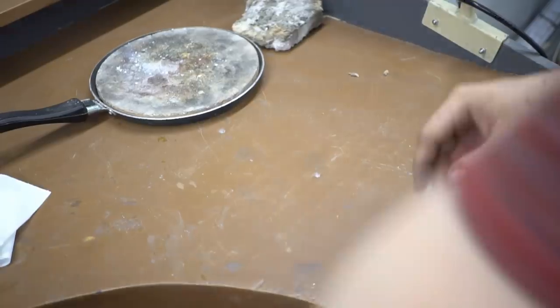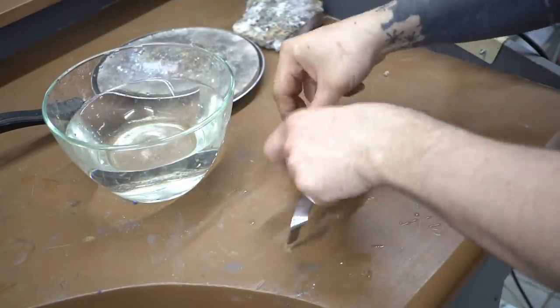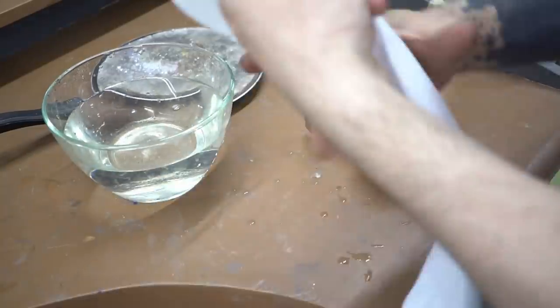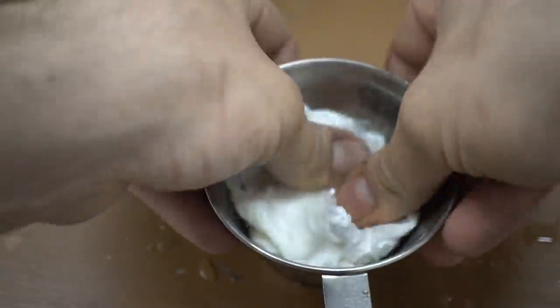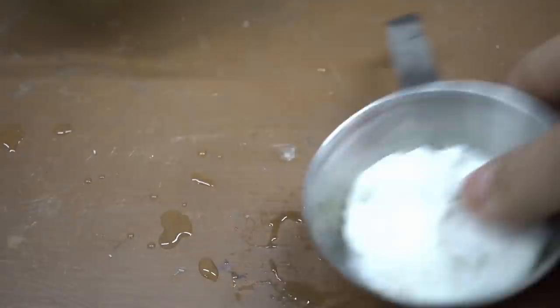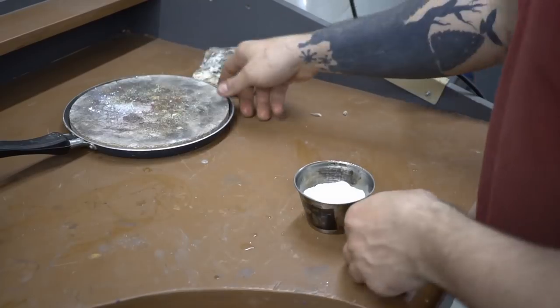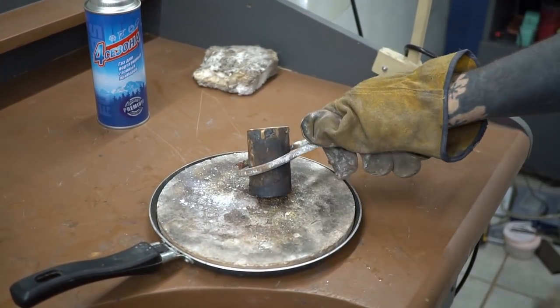This is how I've been heating my molding box for 4 hours. I use wet toilet paper, but anything fits. Paper, clay, potatoes, beetroot, and so on. The idea is to get a damp, malleable substance from which, when pressed against the hot workpiece, moisture will evaporate and create pressure in the formed hole. This will make it possible to squeeze the metal into a mold.